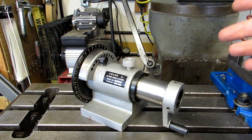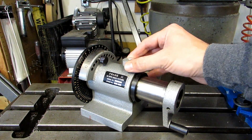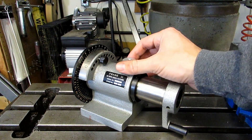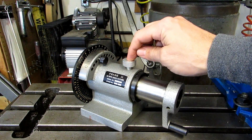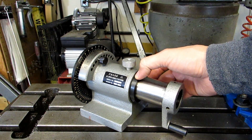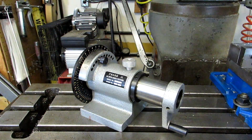Let's talk about a few other anatomical features. First of all, you've got a spindle lock right here that you can tighten up by hand — it keeps the spindle from moving. It's also got a hole in there so you can lubricate it. There's a little shaft collar here that you can undo so that you can get some motion outwards in the spindle for certain jobs.